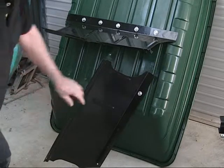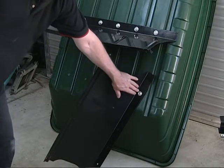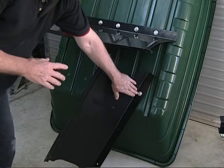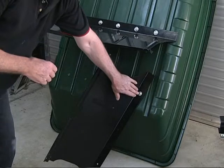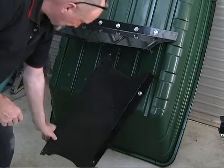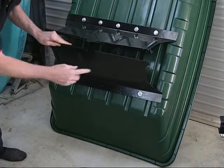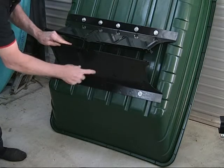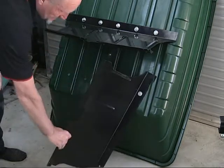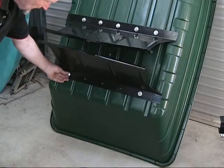When putting the outside nuts on, it's easier to leave off the spring washer because there's not enough room and you're juggling too much to have that on at this stage. For this bolt and that bolt, leave the spring washer off and then put the other ones on, and then once they're on, introduce the spring washer. The second bolt is on.